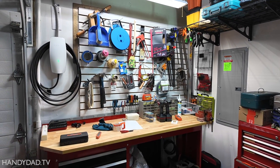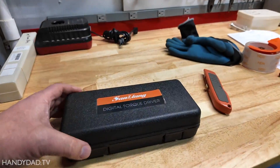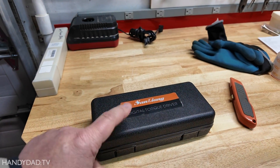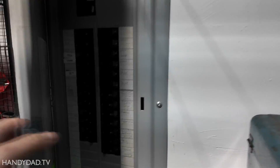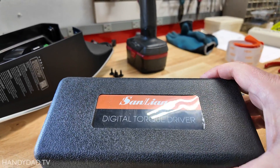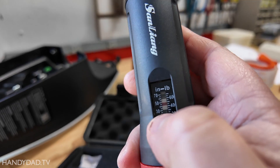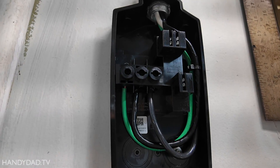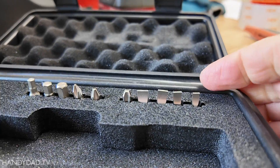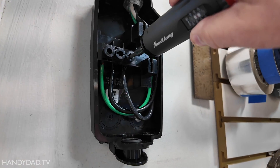Things have changed a little bit in the garage since I installed the wall connector a few weeks ago. I finally have everything unpacked, and that enabled me to find my torque screwdriver, which was missing during the initial install. So now I'm going to open it back up and make sure I torque it down correctly. This is an inexpensive torque screwdriver I got on Amazon. I have it set to 50 inch-pounds, which is what is required by the wall connector. It has a quarter-inch socket and comes with various bits, but I'm going to use the bit that came with the wall connector.